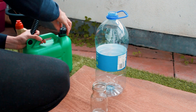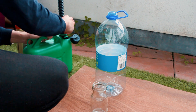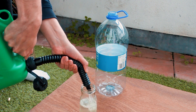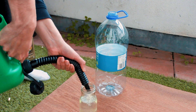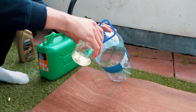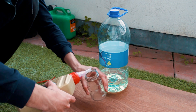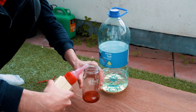It's time to mix the petrol and oil. As indicated in the instructions, I'll be doing a mix of 30 to 1 — that is 30 parts of fuel and one part of oil. I'm using a fully synthetic 2-cycle engine oil, but if they recommend a different one in the instruction manual, go for it. What I'm going to do is take a glass, pour three glasses of fuel, divide the glass in 10 parts, fill one of those parts with oil, and then mix everything together — that is a 30 to 1 ratio.